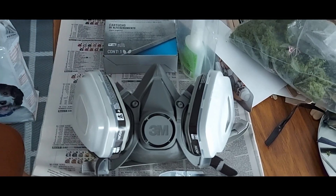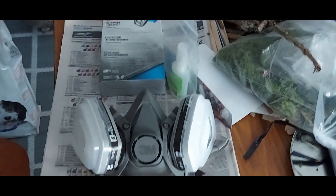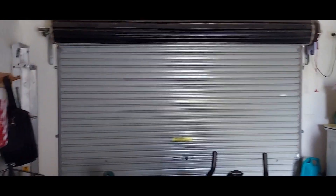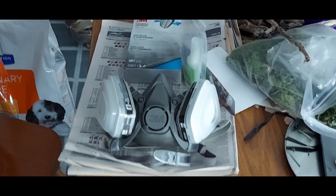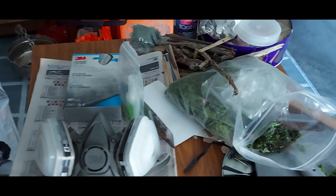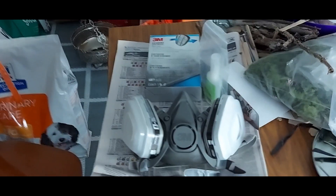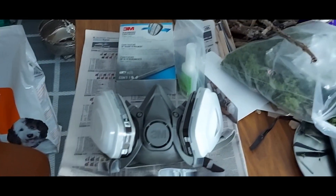I hope that was helpful. I'm not in my normal space — this is the garage — because if I want to do super gluing or work with nasty chemicals, I'd rather do it here. If the weather's suitable, I can open up that end and the back door as well, so we can get ventilation and the vapors from superglue, plastic adhesives, and sprays can dissipate. You don't want them hanging around because they stay in the air for quite a while. And remember — it's not just coming from the bottle or spray can; it's also coming off what you've just glued or sprayed. There are still fumes and vapors after application. Anyway, I hope that's helpful — I'll see you in the next video, bye for now.